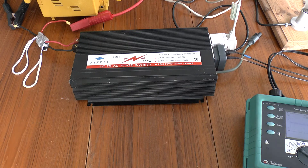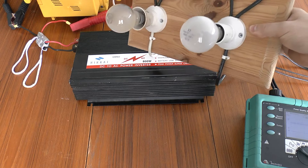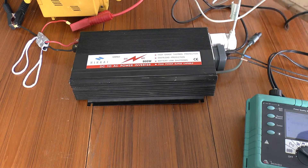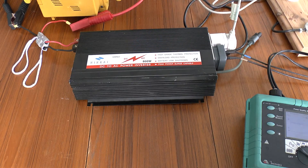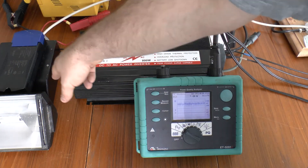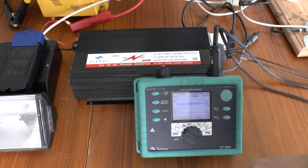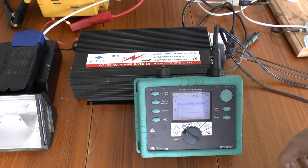That's all well and good when trying to run simple loads such as these 100 watt bulbs. How about something a bit more demanding? Well, I also have this 150 watt metal halide lamp. With the magnetic ballast it wouldn't work unless I took the power factor correction cap out, and then it worked but it's not really the best.